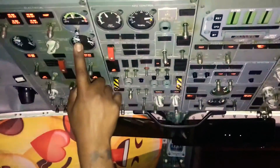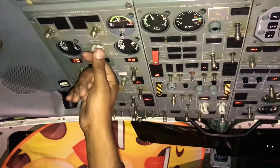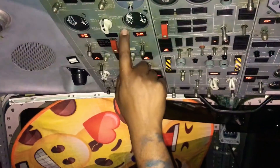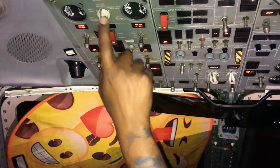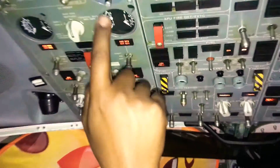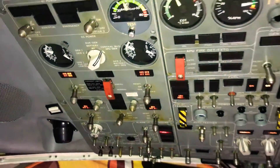We've got our APU voltage and we can put on our invertors. You can check our battery voltage right here. One thing I forgot to mention — before starting the APU you need to check your battery voltage, make sure you have more than 22 volts to start the APU correctly. Normally we leave our switch right here on central bus.